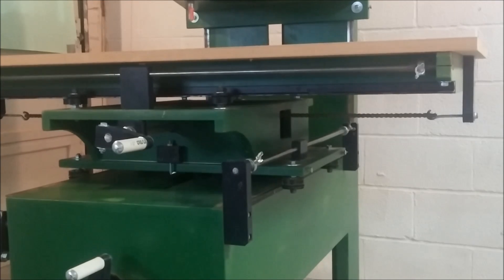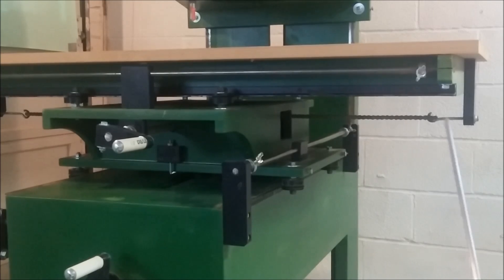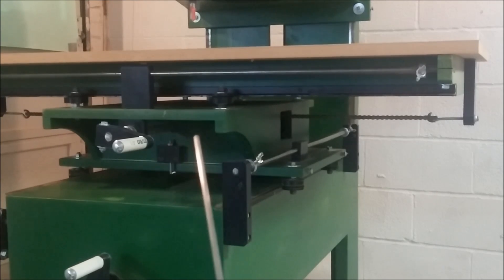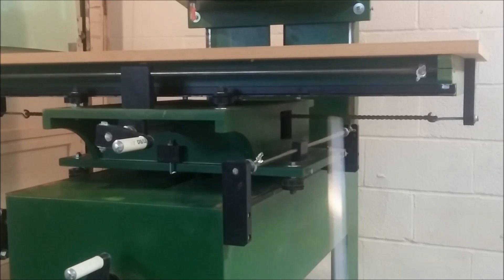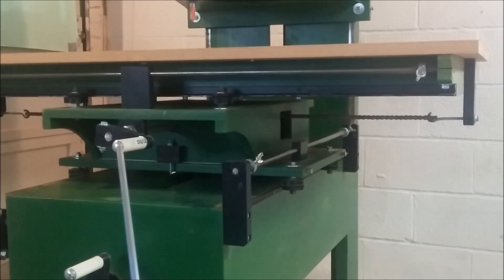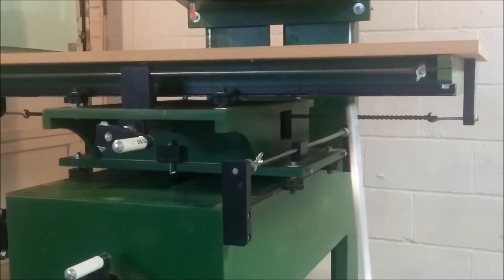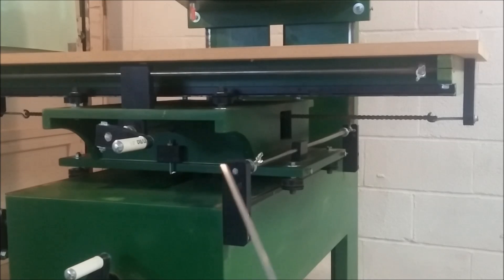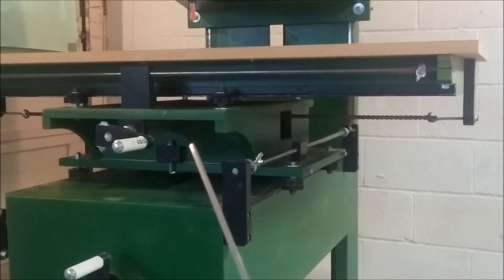Here's a better look at the underside. I use number 35 chain to drive the tables with. There's a 12-tooth sprocket with appropriate idler pulleys to keep tension on it. The nice thing about it is it's absolutely positive — there's no backlash or gear lash or reverse-forward lash from threaded rod. It's very tight and also faster; threaded rod is too slow for a milling machine like this on wood. One turn of my crank moves this table three and five-eighths inches. I also have a little clamp that clamps the bottom carriage here — it clamps the upper part to that with just a screw, and I have the same thing on the back.